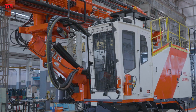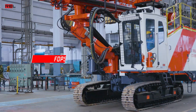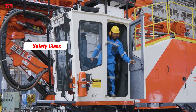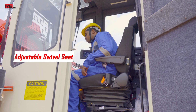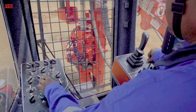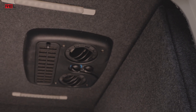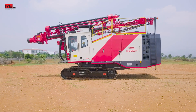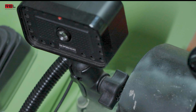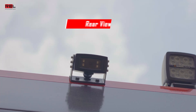The drill is equipped with an ergonomic cabin for maximum operator productivity. The structure is FOPS certified and thermally insulated. It is equipped with safety glass and an adjustable swivel seat. All operational functions are controlled from the console. Additional facilities include air conditioning, cab pressurization with less than 80 decibel sound level, and safety features like operator fatigue sensor, gradient meter, and rear-view cameras.